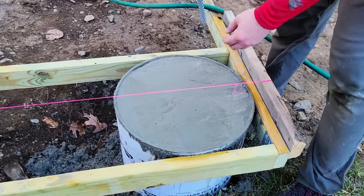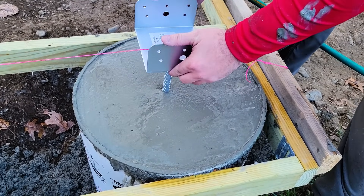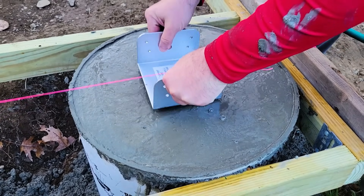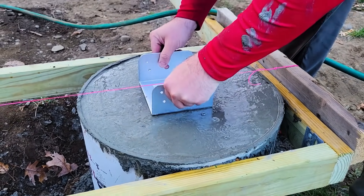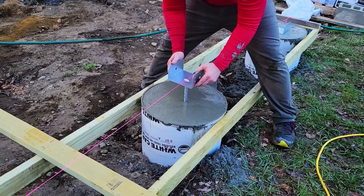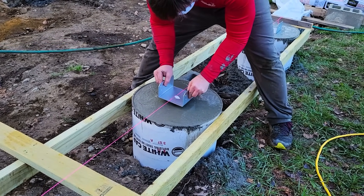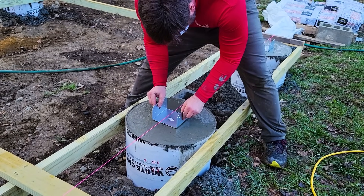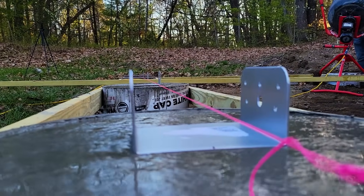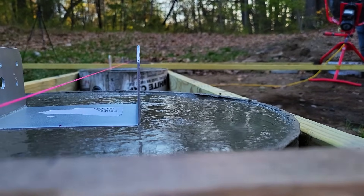Now I'm installing the concrete anchors. These are galvanized steel and the ones I chose meet the requirements that I needed, which is very minimal - I just needed something to hold that beam in place. But there are dozens of different anchors out there, and if you need more uplift resistance or something else you'll have to choose the one that works for you. Off camera I used a little ruler and a sharpie and marked the center of each one, so I'm lining it up by eye with the string so that the center of all these is lined up with the string - it's going to come out to a very straight beam in the end.